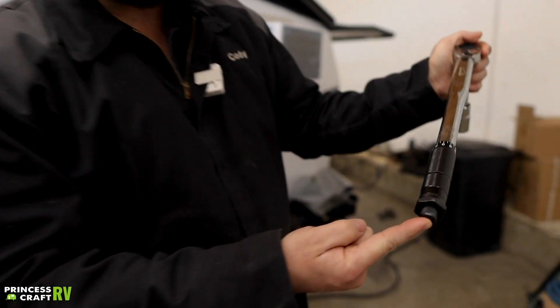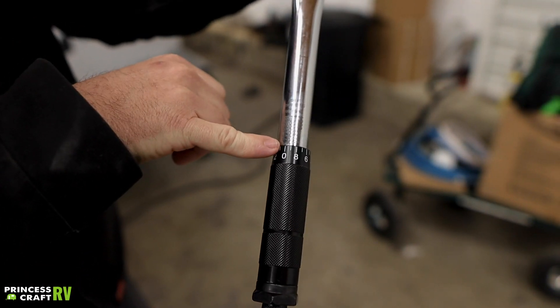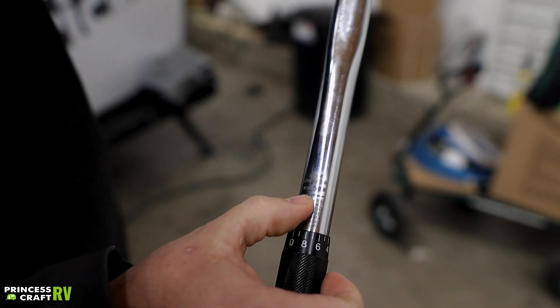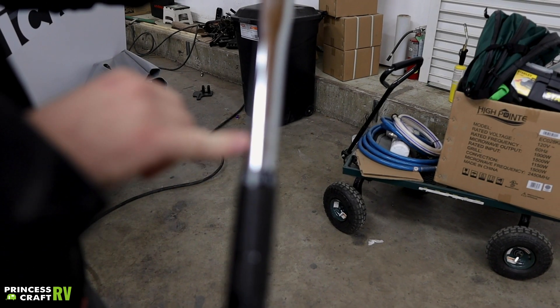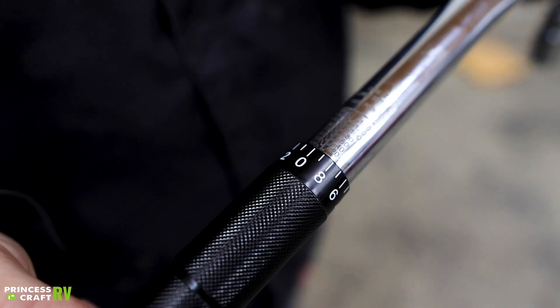What we're going to do is take our torque wrench and loosen this knob on the bottom by turning it to the left, and we're going to look at our graduations — we're working in foot pounds. Most torque wrenches will have foot pounds and newton meters; we want to work in foot pounds. Our torque wrench here goes from 10 to 150. So we're going to turn it up to 100.